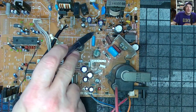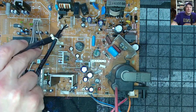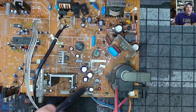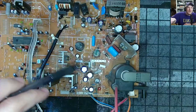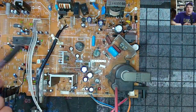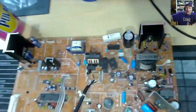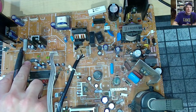And so it goes under, everything under that line, then you cut over here to this point. See, it goes straight here, it goes down, cuts up this line over here, back over to this part. All of that right in there is our deflection. Every one of those is a deflection capacitor. So if you have any deflection issues, it has to be a capacitor inside of here. Changing a capacitor next to this, all this will not help anything on your image. Nope. Or heck, over here, if you start messing around, this is audio. That's going to do nothing to your picture.